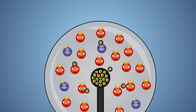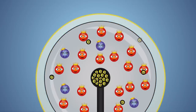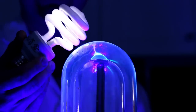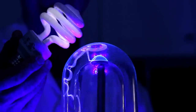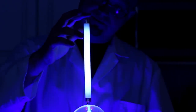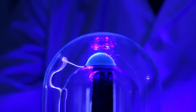The charged-up electrode and quickly-moving electrons generate an electromagnetic field. This field isn't contained within the glass walls of our sphere, and extends beyond the glass. When we bring our compact fluorescent bulb within close proximity of the electromagnetic field, the gases inside our bulb gain energy, exciting them, which is quickly released as light, which can be seen in our experiment. The type of gases used inside the sphere will change the color and shape of the arcs, as well as the amount of energy needed to create them.